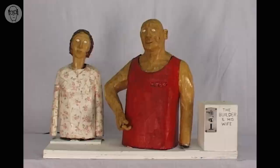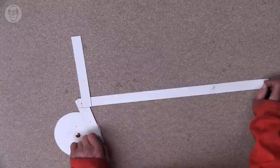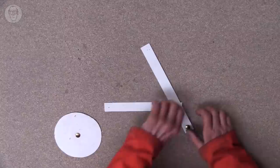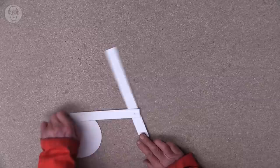So you can get a lot of different sorts of movement out of a simple crank. This is like the actual model I made, and also like the flowers in the waterclock. The movement of this lever is almost vertical. And that's because this crank distance is much shorter than this long lever here, at the fixed point there. You get a completely different sort of motion if the lever connecting to the fixed point is only a bit bigger than the crank, which I'll try and show you now. So now you get a really big angle, like a sort of extreme version of a car windscreen wiper.